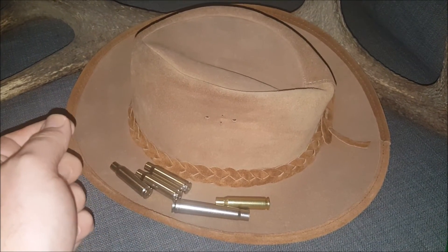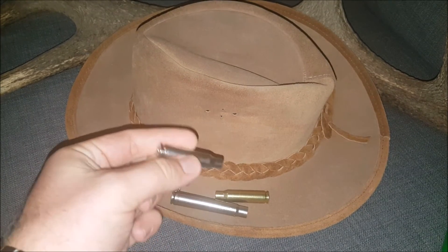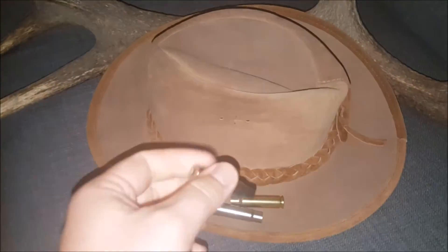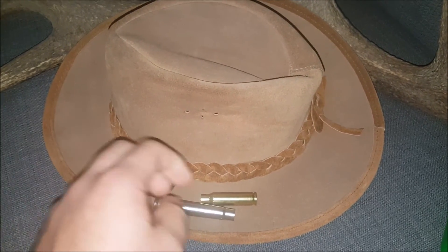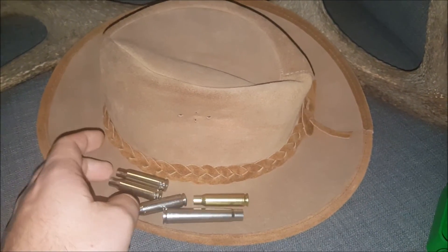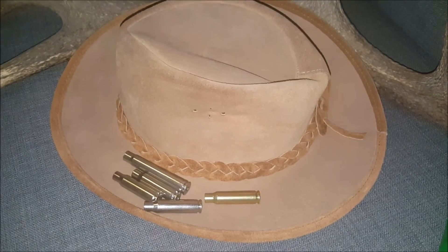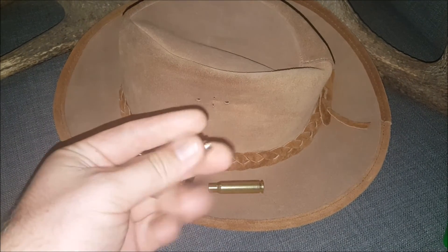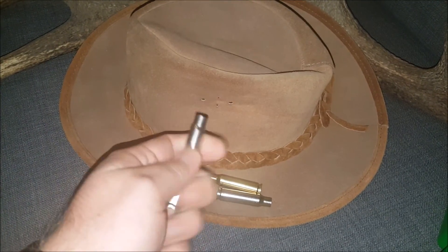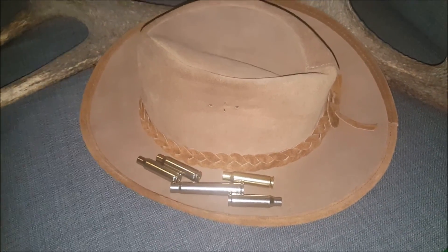I'll keep you informed how these hold up compared to standard brass cases. It's no witchcraft — everybody can do it. I bought the nickel electrolyte from eBay for 26 euros per liter. Gold electrolyte is ridiculously expensive at 540 euros per liter — I bought 100 milliliters just for fun. I won't chrome-plate these because chrome is too hard and would ruin my dies. Nickel has proved to be reliable and works just fine. Thanks for watching — give me a thumbs up if you liked it, and see you next time. Bye!